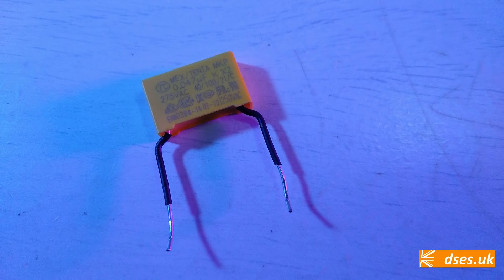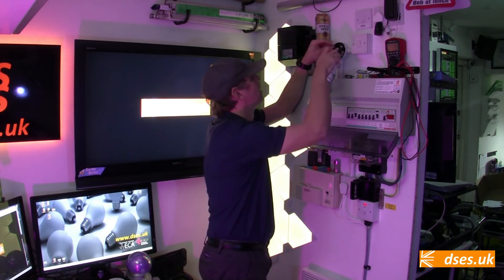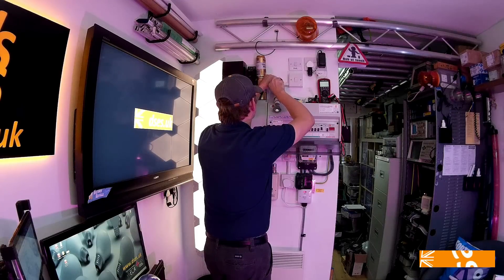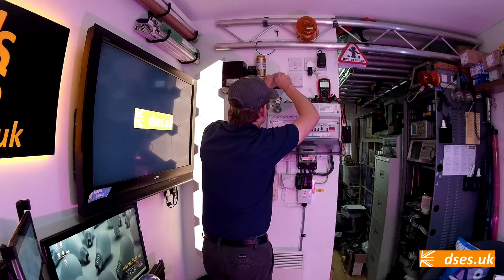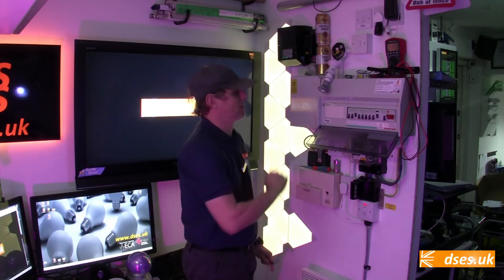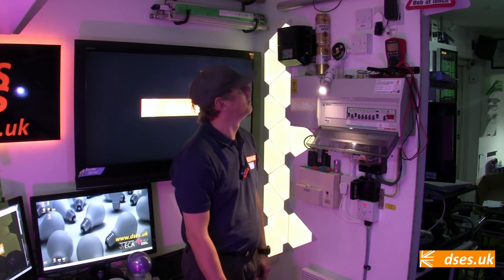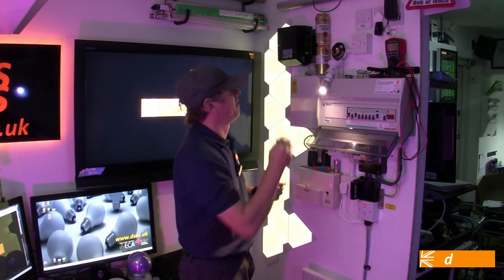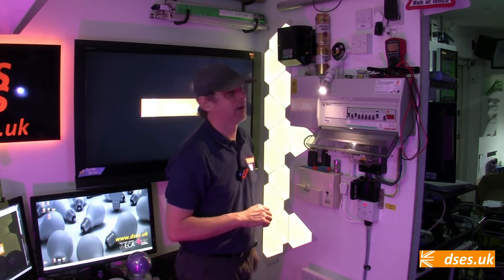That said, a capacitor may be a better solution. I happen to have an X2 capacitor right here — rated at 275 volts AC and 0.047 microfarad, with insulated leads. Let's put this in circuit: we can see we've got our nuisance glow, and already I can see the lamp has extinguished as I push that wire into place. Our capacitor is fitted, our nuisance glow is gone. Let's see what happens when we turn the light on... Marvellous — no ill effects. Not a bad solution at all, and it can go into place with no problem.